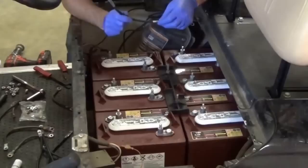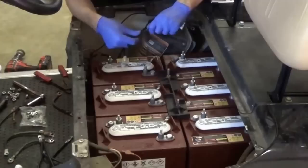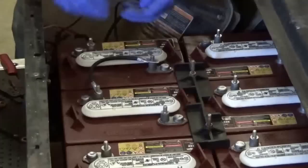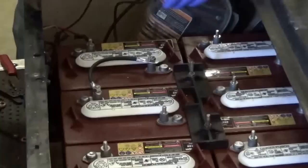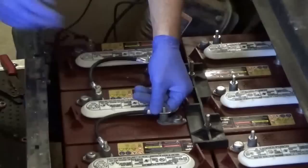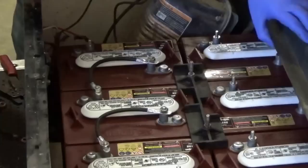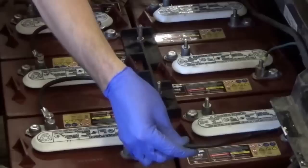You always want to make sure you're watching where both your metal cable ends are. You don't want to complete a circuit because you're going to have sparks flying, and that's never a good thing. Starting from where the positive begins, you're always going to go positive to negative, positive to negative, all around the battery bank. So for instance: here you've got a negative, you roll right into a positive, then put your nuts on. We have all new hardware from Trojan — all new nuts so everything is clean. So going negative to positive, then another negative to positive again, nut that down. Replace as much of the corroded material as you can — it's going to help prevent corrosion from building up faster in the future.